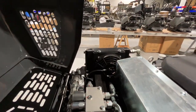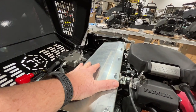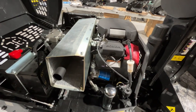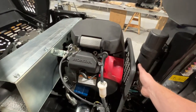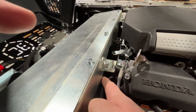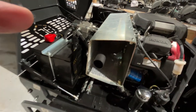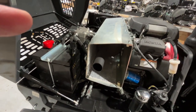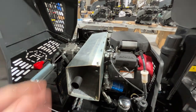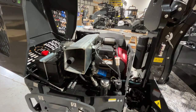Should you need access underneath, you have just two bolts to lift this heat shield off. In some very hot territories where heat could be an issue, you actually intake air from the rear of the machine. It blows through, and there's an opening here that scrubs the heat off of the exhaust and out the side of the machine. So this machine really runs cooler — between running the hydraulic cooler and how we're scrubbing the air off the exhaust — to make sure we don't get heat buildup inside.